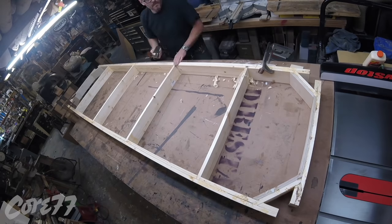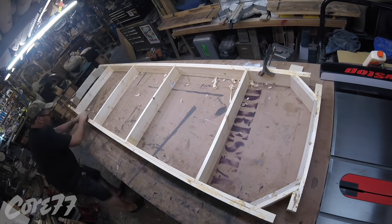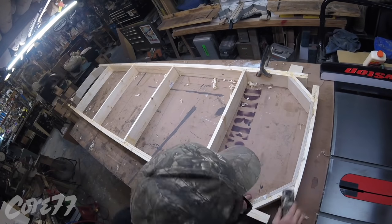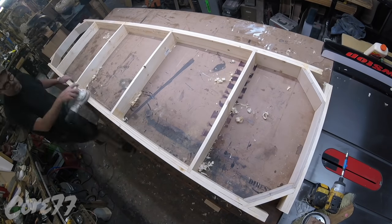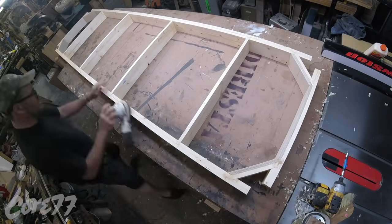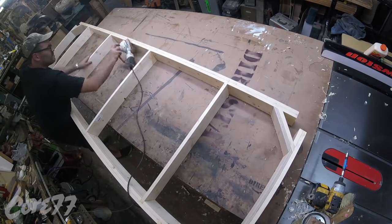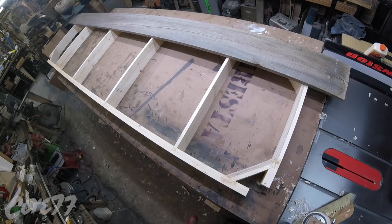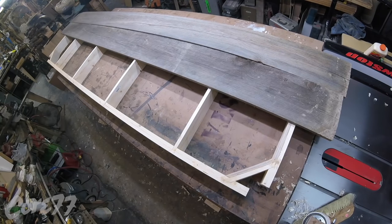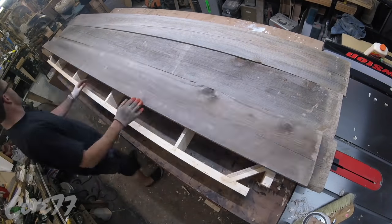Now I'm just cleaning up the frame — there's lots of glue everywhere. I'm using a hand plane; when I plane glue I use this old Stanley that I have, but once the glue is gone I use the more refined planes. Just palm sanding, getting rid of any kind of edges. That wood was bought at Home Depot here in America — we have a knotty pine aisle. Those individual pieces were $10 each, 12 feet long. They were 1 by 6 and I cut them down to 4½ inches.